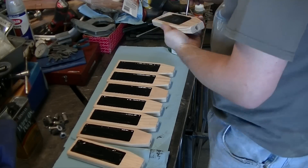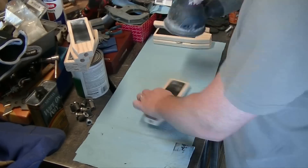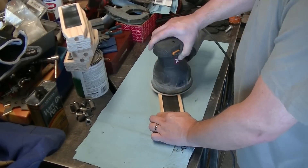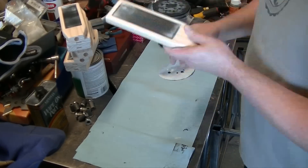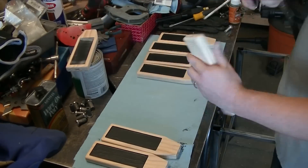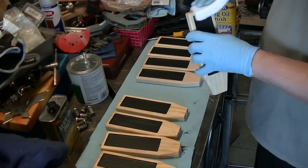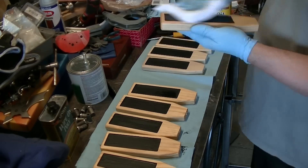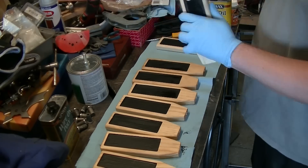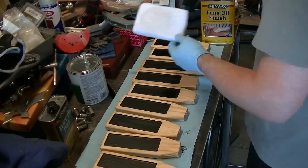After this it was a lot of sitting around and watching the paint dry — each step of this required an additional day. After all the sanding and everything was done, I went ahead and put a coat of tung oil on these, just to give it a richer color and to help match the interior decor of the brewery itself. Tung oil also helps keep some moisture in the wood. You have to let it soak in, and again, lots and lots of watching things dry.